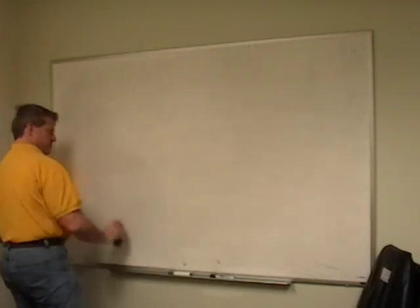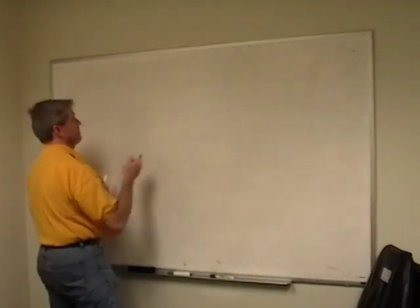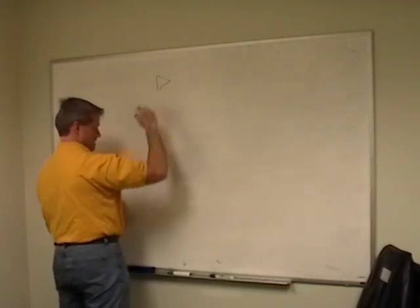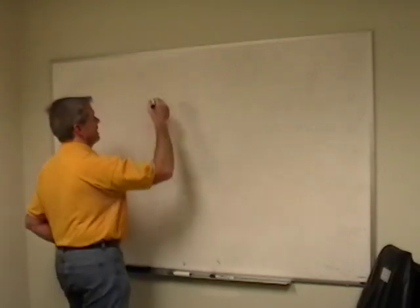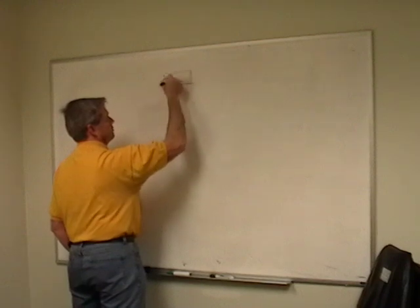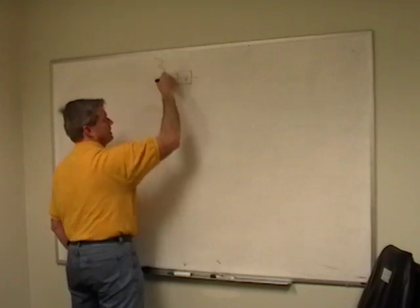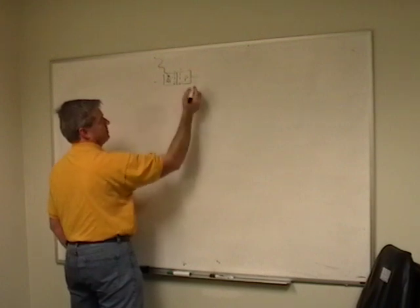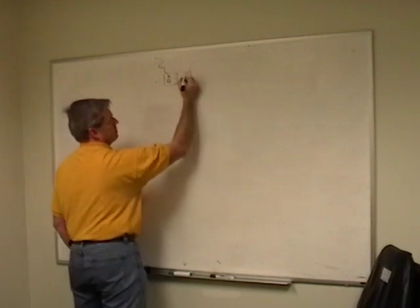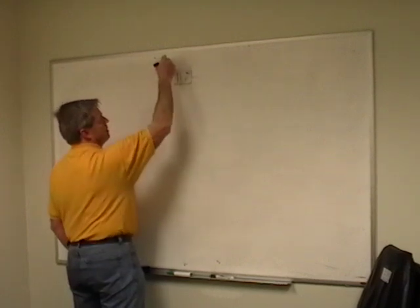Is there any practical use for all this? I'll tell you one. We talked about diodes earlier. If I've got a diode sitting out here in space, wouldn't it be neat if I could just take this PN junction? What happens at this PN junction, with my diffusion length right? What happens if light lands here? Well, an electron hole pair is made and then they recombine. And if light lands here, I get an electron hole pair, EHP, but then it recombines and goes away.